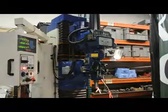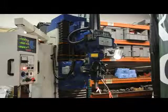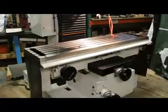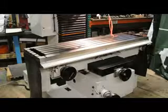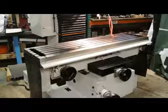Let's run through the options. We've got 5,800 pounds of overall weight, number 30 taper spindle, a three-axis DRO, and a power draw bar for the Z-axis. X and Z DC servo motors. We have hardened and ground table ways that are Turcite-lined on the bed mill style frame. It has a double-nut precision ball screw, hardened and ground for high accuracy and long life. It has the meehanite casting. The machine was 100% laser tested for position accuracy and repeatability. Complete auto lube system — one-shot lube. It has a halogen work light, as well as covers for the cross, the table, and the vertical column.